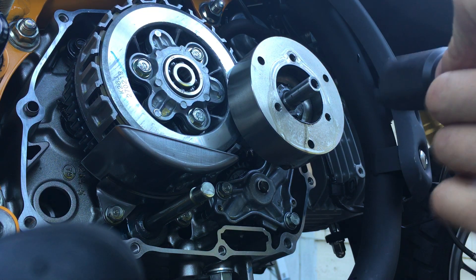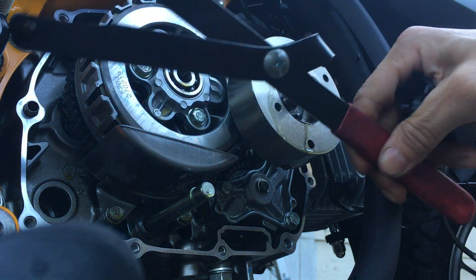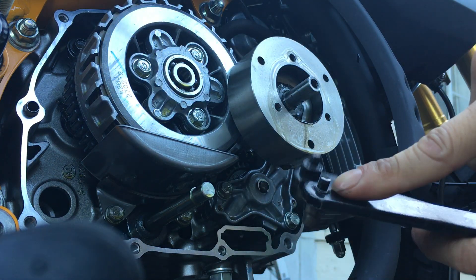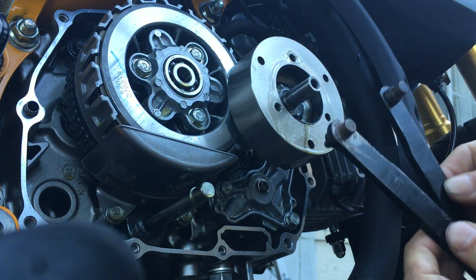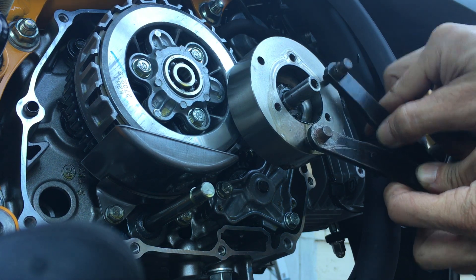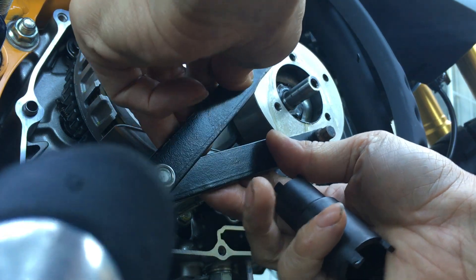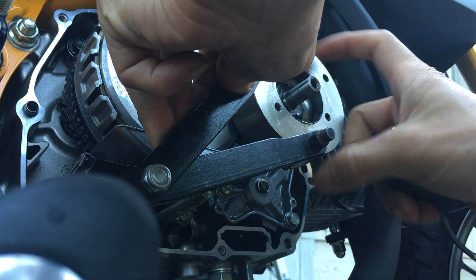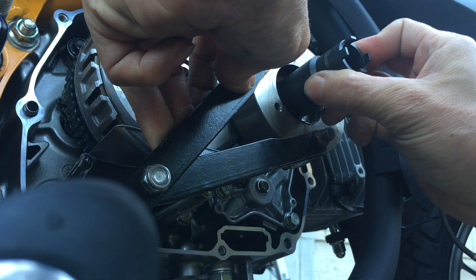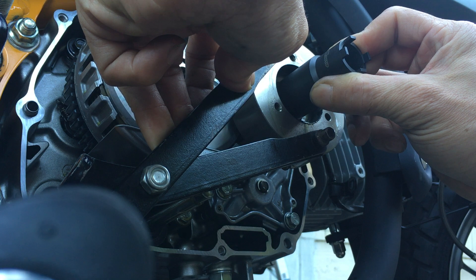This holding tool has these little pins on the end, and that little pin can actually go into the holes here — like so — and that could hold it still so it won't move. And this way you don't have to use the impact driver; you could just use a regular 3/8 wrench to take this off. That might be a good idea, because the impact driver is harder on things, and over time the impact driver will basically destroy the steel tabs — they're not that big, they're not that strong.